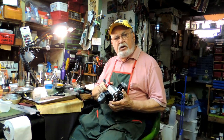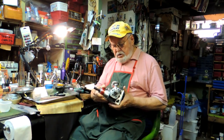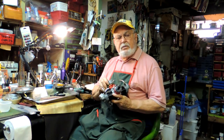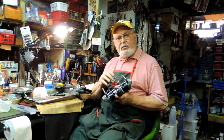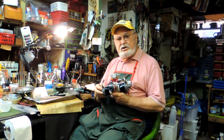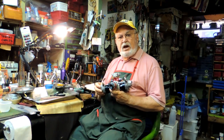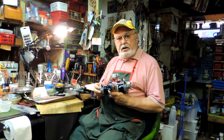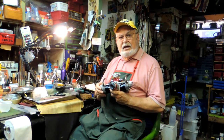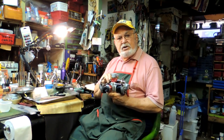Hello modelers, we've got something a bit different today. I've converted this OS Gemini 300 engine, a 50cc glow engine, to petrol. For this conversion I've used the Morris Mini Motors conversion. Morris Mini Motors in the UK supplied the carburetor manifold and ignition system, all on the front. Quite a good bit of equipment - very nice engine. Unfortunately the engine is no longer manufactured by OS, but we're hoping with this video and the test write-up that the Japanese company might consider putting out the engine again in spark ignition. A 50cc horizontal opposed engine is a very popular size. Let's go and see how it runs.